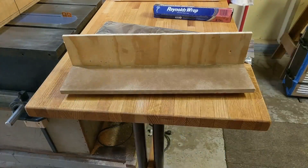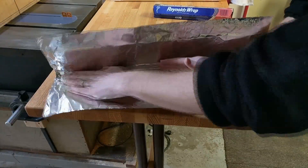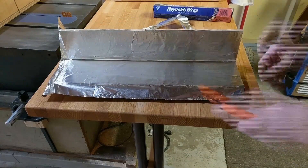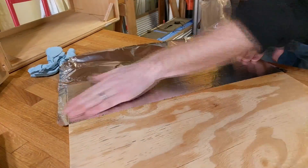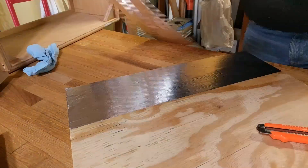When preparing the cabinet for the electronics, you may have noticed back in part 1 that I covered the control cavity in aluminum foil. In my effort to block out unwanted noise and interference, I tried to create a shielded enclosure around the electronics by using spray adhesive to glue down some aluminum foil. I did that way earlier and ended up redoing it, as it got all messed up during the hole drilling and tolexing of the cabinet. So I'd suggest doing that as late as you can.